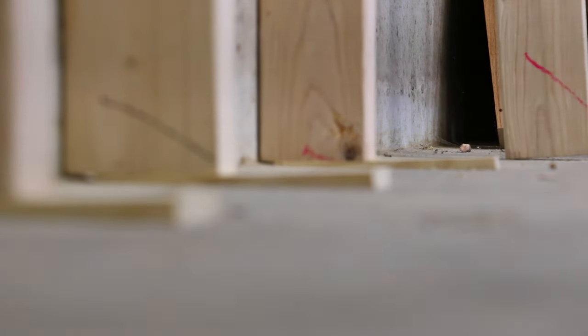So I decided on this approach: basically you take a two-by-four, screw it into the beam at the top of the ceiling, use a level to make sure it's as straight as possible, and then pound a wedge underneath the two-by-four at the bottom. That wedge presses the two-by-four against the wall and supports it so it can hold weight. The wedge idea comes from Steve Branham of closegrain.com, who used it in his workshop.